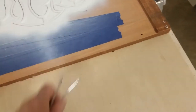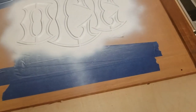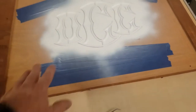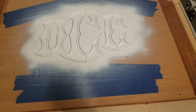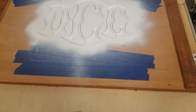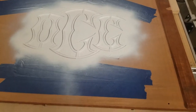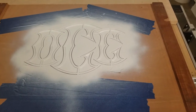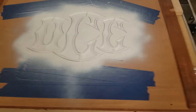I picked out debris manually with small picks, working my way around. There are some areas where sharp corners got knocked off — that's wood grain. At a three-foot view you won't see it, but when you're examining your own work you're always more critical than your customer is. This was a one-time demo showing Adobe Illustrator vectors imported into V-Carve, processed with V-Carve toolpaths, and sent to the machine.